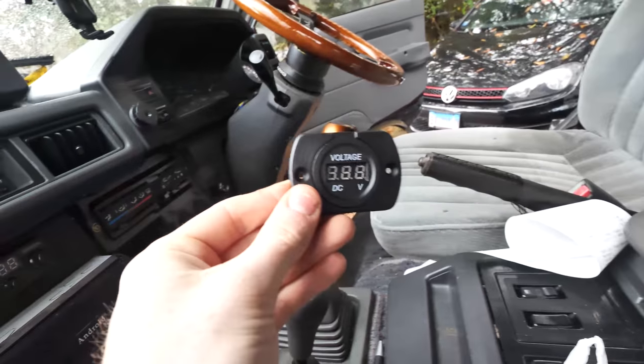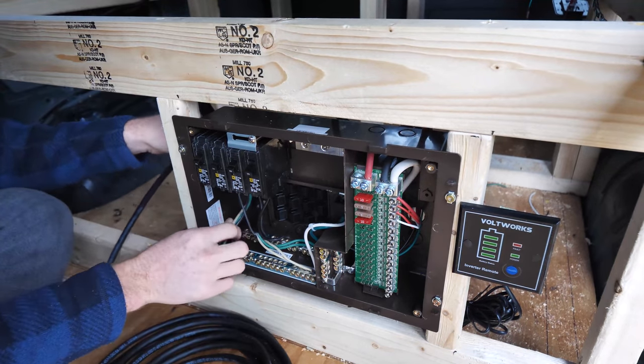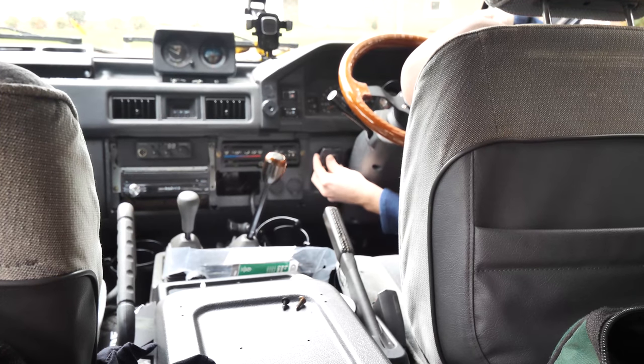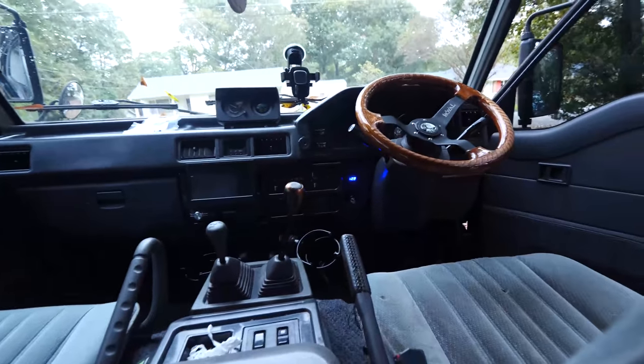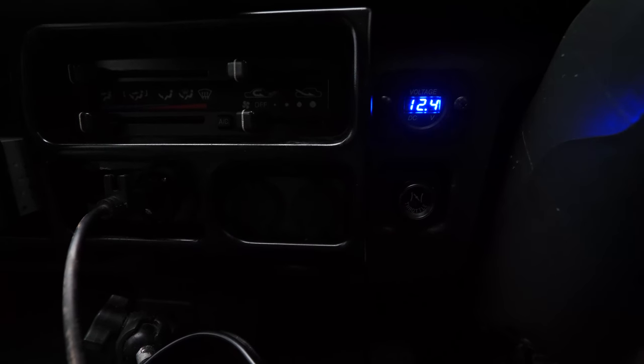What is it, day three, day four? It's still raining, but it is at least just spitting today, so I'm gonna work on the stuff that requires me being around the van. We've got a 120-volt outlet up here along with a voltage meter for the RV battery up here. So we got our voltmeter and our 120-volt outlet packed with the battery — sure enough, 12.9 volts! Let's turn on the inverter, turn the main thing on, and turn that thing on. The outlet works, and you can tell the voltage is also working because the voltage drops a little bit when you turn something on.